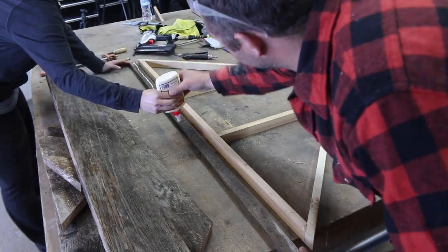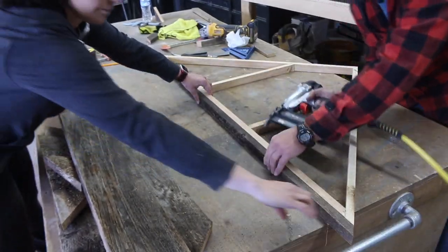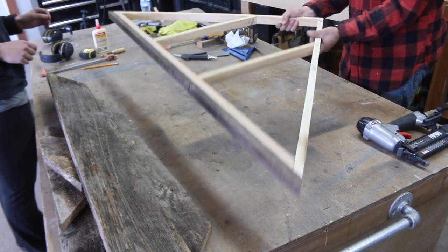The front trim piece was then attached using wood glue and finish nails. Now, this is the board I ended up deciding to make wider in a later step, so if you want to use a board that's a little wider for a more bold look or to help hide wires, now would be a good time to add it.